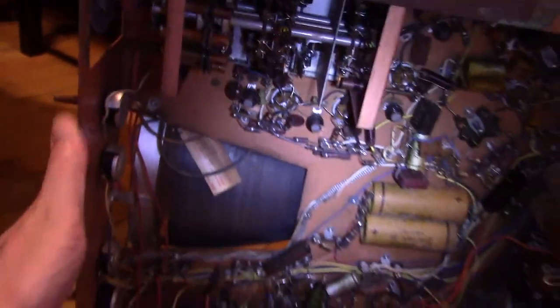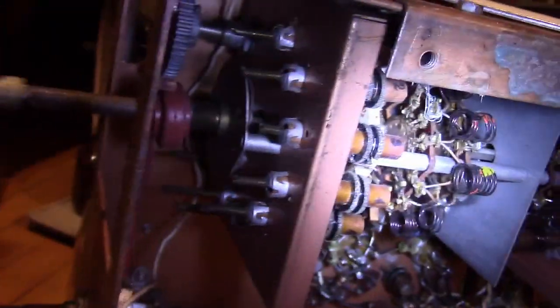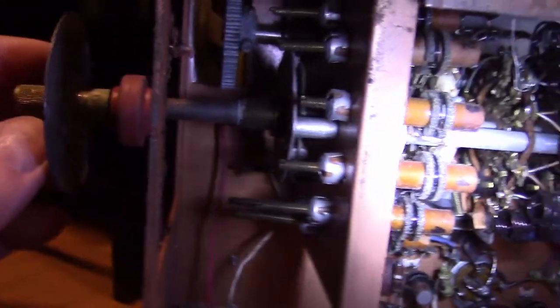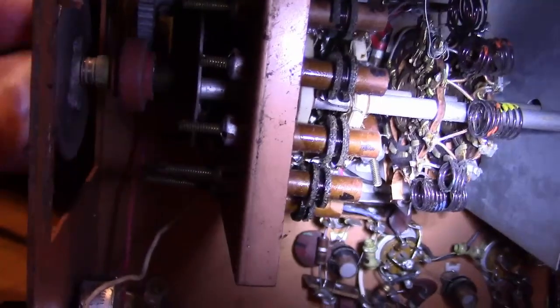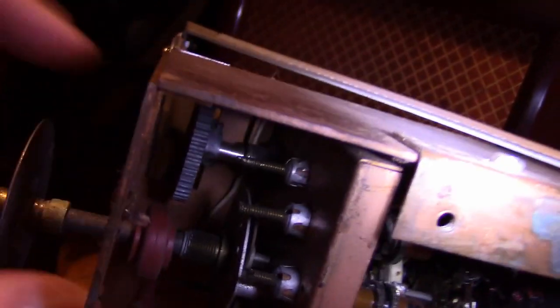This seems rather odd to me how this was set up. Some of the knobs that came with this were from the wood version — they're brown knobs. And the channel selector kind of came apart in two pieces. This was stuck inside the cabinet, and then there's this weird bit of rubber here. This is definitely not original, because the fine tuning knob is supposed to engage this gear up here — and obviously we got a little problem here. That rubber bushing sure isn't making contact with anything.